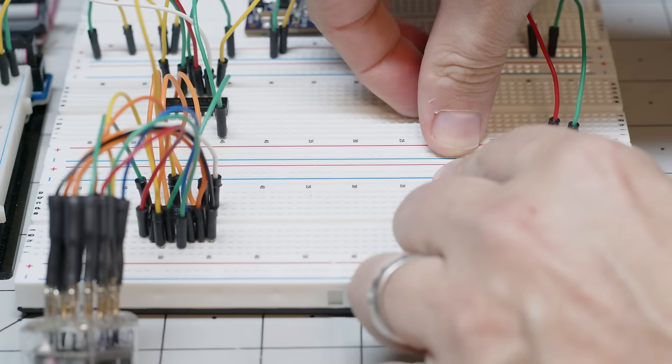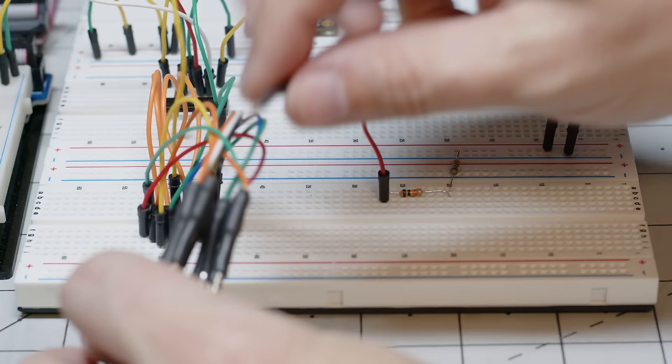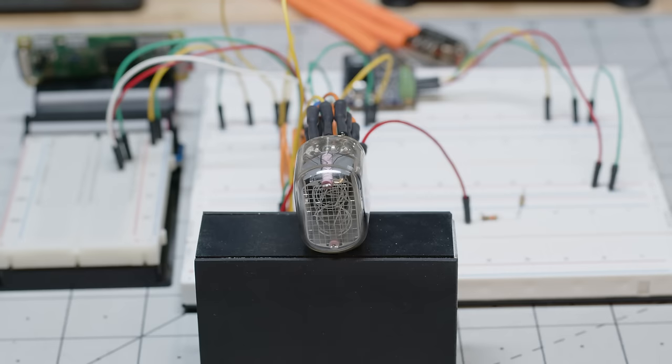With the components connected, I just need to add the power. I'm adding 2 resistors here that equal about 15,000 ohms to control the current. I'll add a single resistor in the final design, but this is what I had on hand. With everything connected, it's time to test.